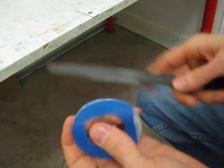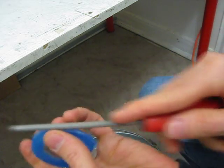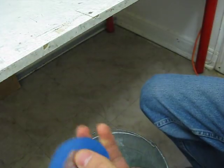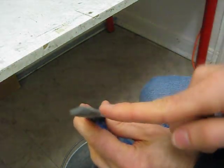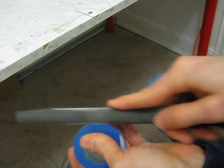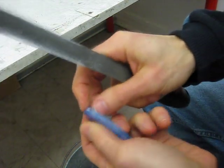The next trick is to make the groove. To do that I use another file. Ideally what I'd do is take this round file right here and just go along like this all the way around — that's in fact how I made this one, and it worked out great. But this was thicker plastic. So I can't use this round one. Instead I'm using this one, which is round in one profile and flat on the other side, and that way I can get in right there and file away, then reverse direction and reverse side, and keep doing that. And I've got a nice groove forming right there.